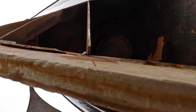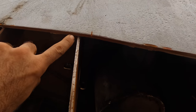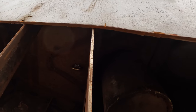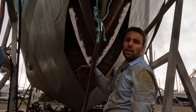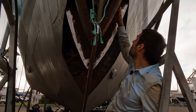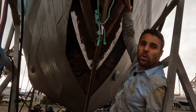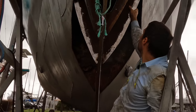This other side, if you look along there, doesn't really show up on camera, but there's quite a warp in there. I know that because that mark there is where the bulkhead needs to be, and that's where it's sitting. The difference is basically how much this panel has a warp in it. That's how flexible 6mm steel can be. I don't think I'm going to get this slide into the original position. It's always going to be 5mm out, which is okay. Not perfect, but it's acceptable. But because of the warp, I'm going to have to push this slide backwards, which probably means pushing against this rib. But the rib isn't hugely strong in that. Oh, you know what I'll do? I'll weld the sideways verticals in, and that'll stiffen this rib up, and then I can push against it. Good, problem solved. And why is 5mm out acceptable?